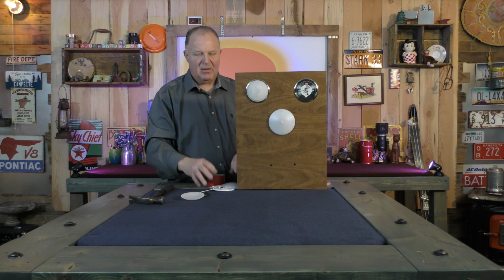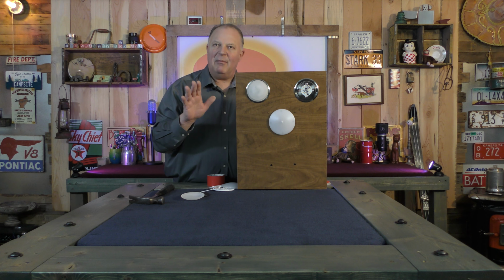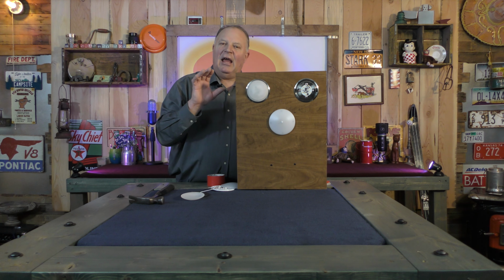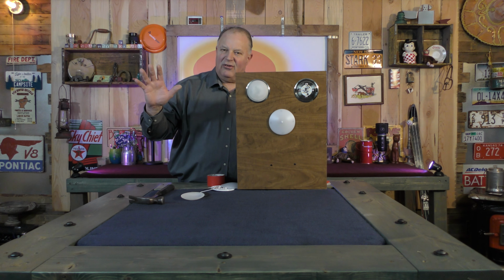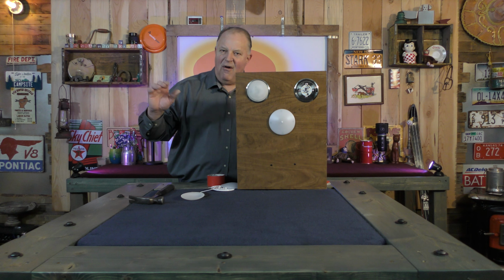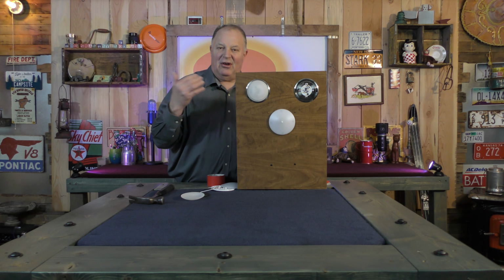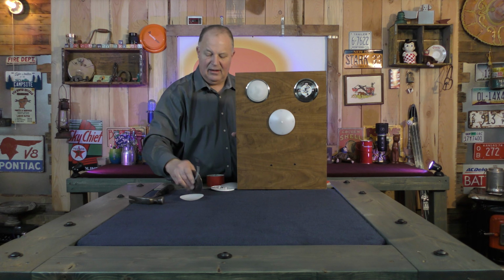No issues. So what I'm going to recommend, and this is a recommendation based on experience of these lights failing. Quite often you don't know when they're failing because they come on, like I said, when they're not supposed to. They might stay on for hours, draining the battery. Or sometimes they just stop working at all. This LED array in here can fail.